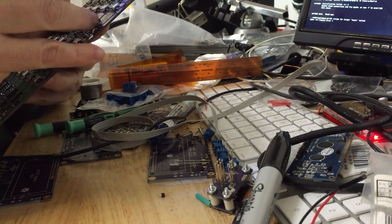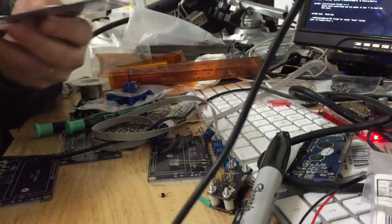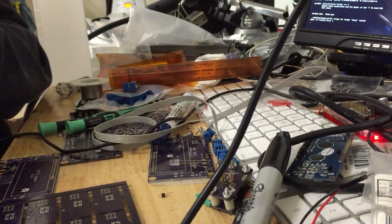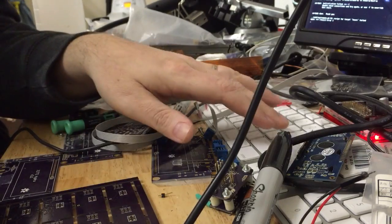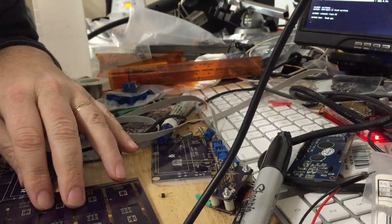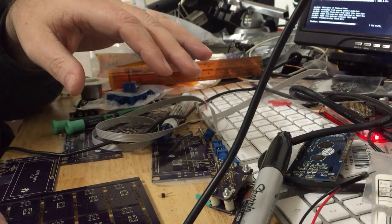So I'm wondering if maybe that might have been a defect in the stencil. Okay, so that's all it takes: you touch the board, the 2 pins in question, with a soldering iron, and just heat them up and then pull the iron away, and then they just, boom, magically go.